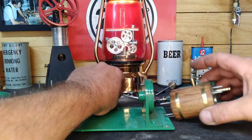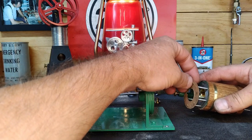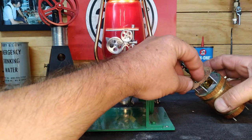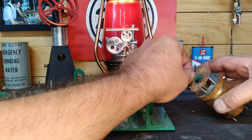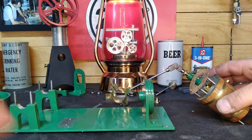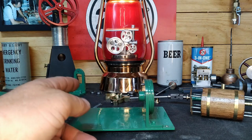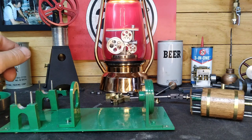There we are — studs back in front and rear. We'll take our rear cylinder cover gasket, slide it on, and mount it up to the base. It's real thin gasket material so it'll be a bit of a struggle, but it was on there before so it should line up. We can't put the front cover on yet — we have to slide our piston in and get our crosshead guides mounted first.